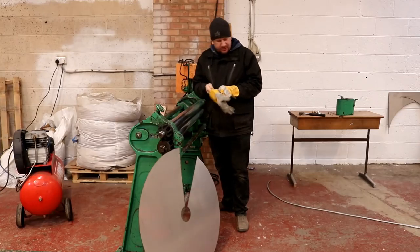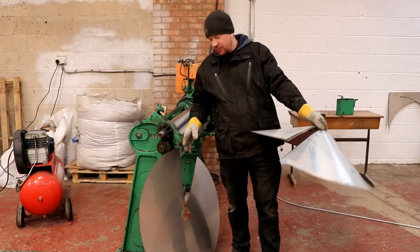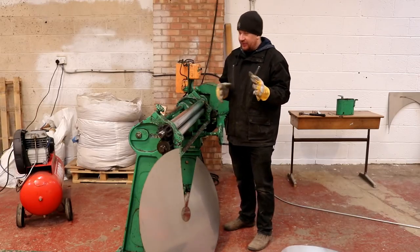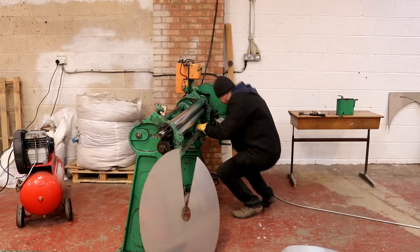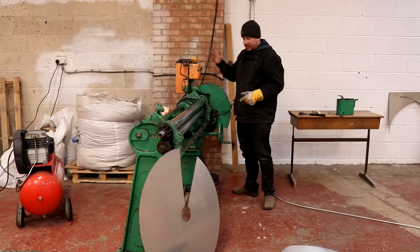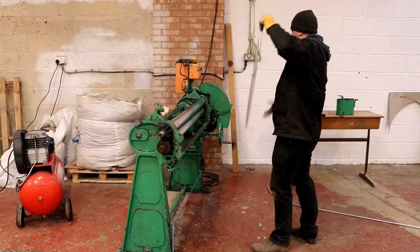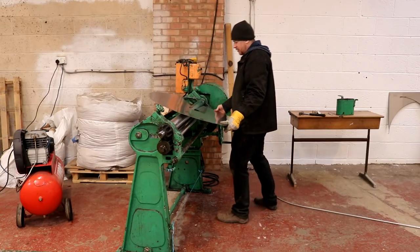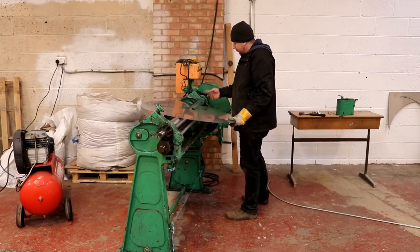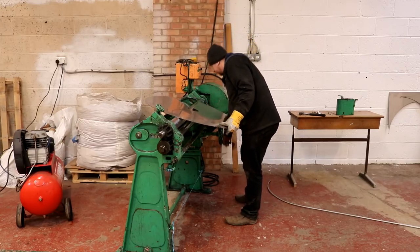I'm going to roll one of these cones out. These two I've got here are flatter — the flatter cones, one for the mash tun, one for the boil kettle. What I'm going to show you now is how I've been rolling them, and there is literally no science behind this — brute force and ignorance, folks. I have to be careful not to get myself trapped in the machine, and in order to do that I remove one glove. I'm handling the stainless but I've taken most of the burrs off. What seems to be working is to get a front edge in the roll. It's actually harder with these than it was with the steep cones. Turn the machine on, put a bend in it, take it out, wrestle it, put a bend in it. You'll see it's not pretty, but let's have a look at how she goes.